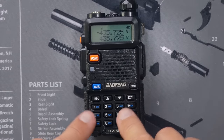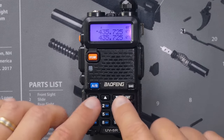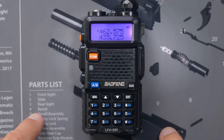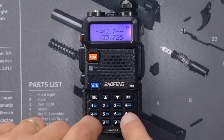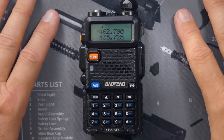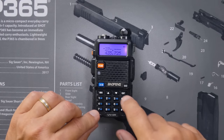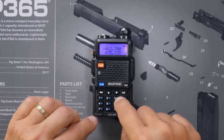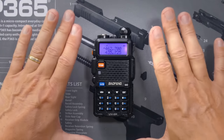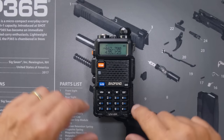When you're in channel mode, you can't directly go to frequencies — it won't let you. All you can do is go to channels by typing the channel number in or going up and down. If you want to directly enter a frequency, you have to go to frequency mode. Then you can enter whatever frequency you want, as long as the radio is capable of receiving or transmitting on that frequency. Many people ask why they can't put in 2700 megahertz — it's because the radio can't transmit or receive in that range. Read your manual so that you know the frequency range before putting in a frequency it doesn't like; otherwise it will just give you the 'screw you' tone.